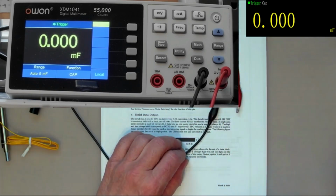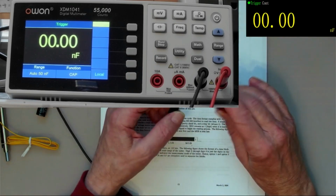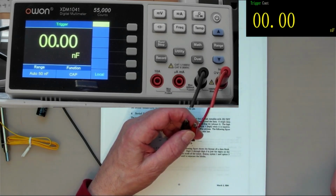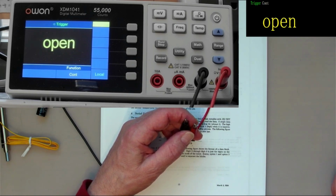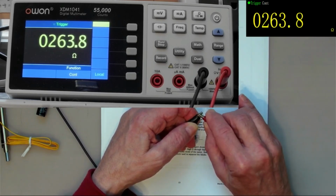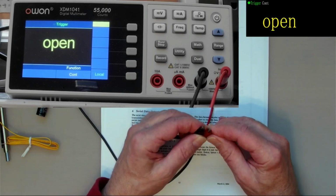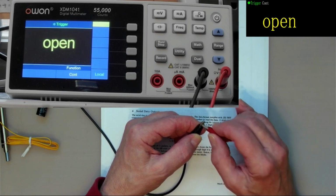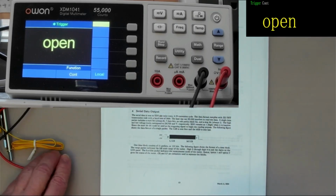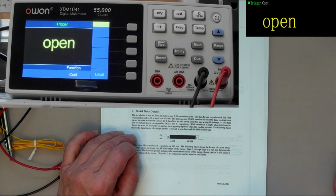And similarly, if you take the thing into continuity mode, and even when you're measuring voltage, it is just really slow. So when I put it into continuity mode here, it's supposed to beep, but if you just touch something, it's too slow. See, it's not beeping. You have to hold it for a while. I guess you can get used to that and just be a bit slower, but still, if you're going to a circuit, you just want to be quicker with it. And as I say, similarly, when you are measuring voltage with it, it's slow. And so I wasn't quite happy with that.